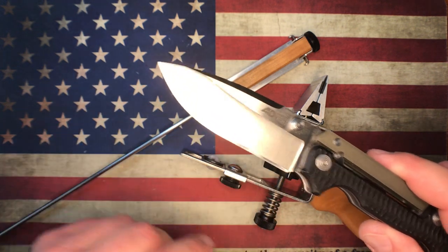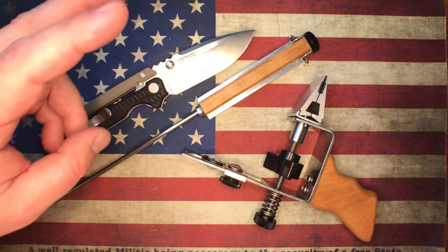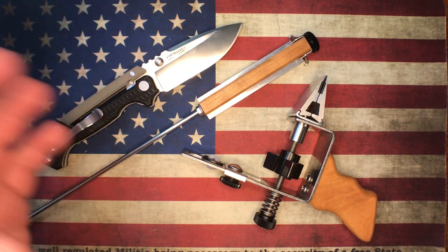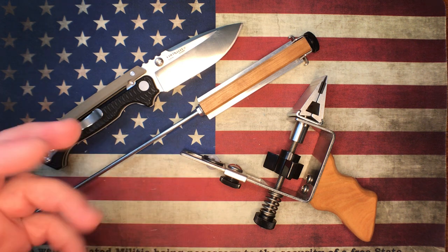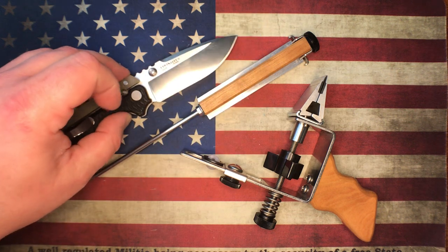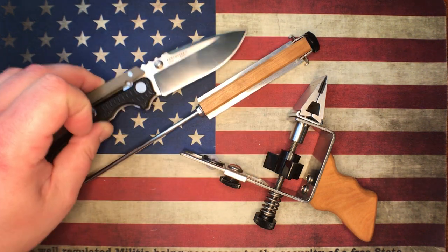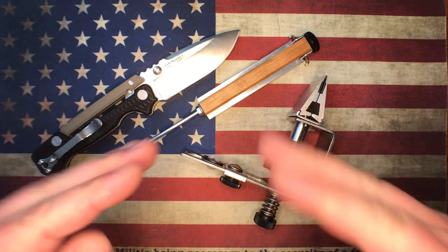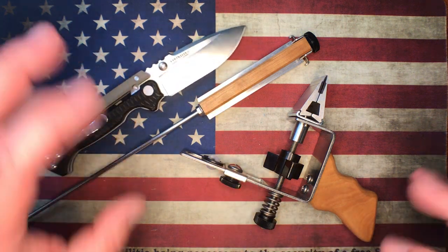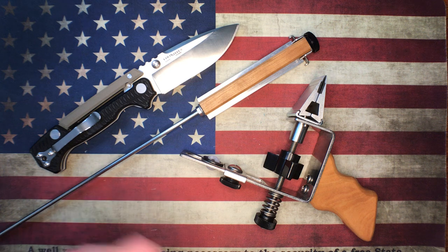I just like the finish better on this one. However, as far as sharpness is concerned, the steel and the stones you use — whether it's a super steel or not — doesn't really affect sharpness. You can make a non-super steel just as sharp. Now this edge will last longer; it should have better edge retention than AUS-10. There are a million variables, but when it comes to just pure sharpness — how fine of an apex did you get on the edge — that's what this setup is doing, putting a nice apex. I was able to achieve a really good edge with both systems.